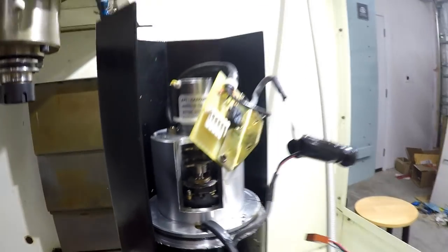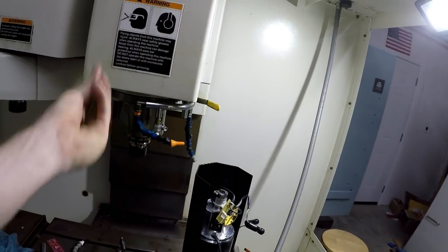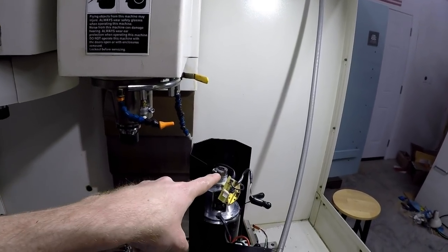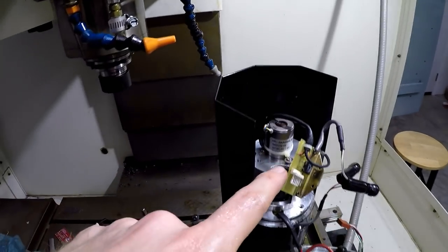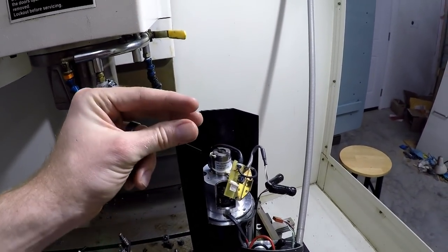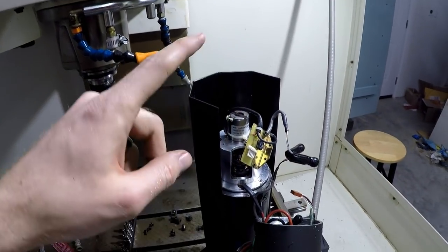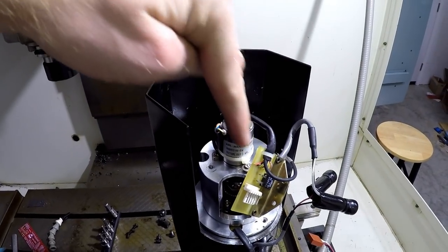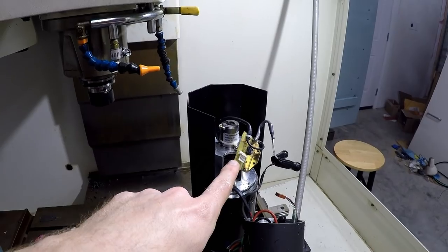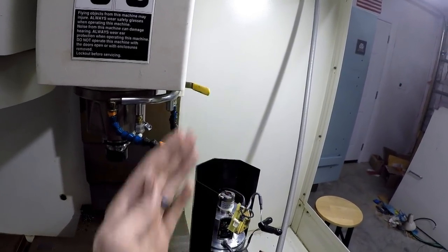But I gotta take that little set screw out, or unscrew it, and then you take that guy out. When you put it back in, you don't want to screw up your resolver. So what you wanna do first is stick the shaft of the resolver into the coupler. Don't tighten it yet, but tighten the cams up here to lock it in place, and then tighten that guy. That way you're not binding the shaft of the resolver and it's twisting and binding.